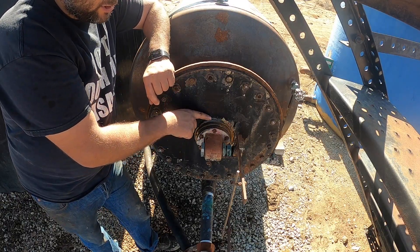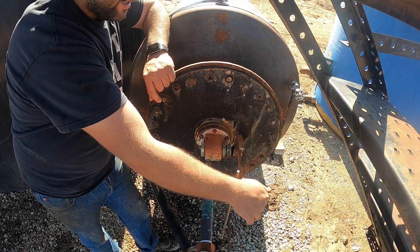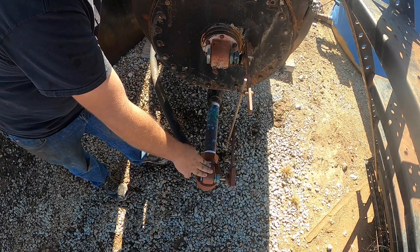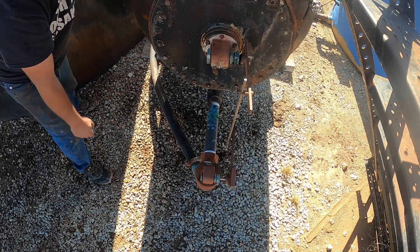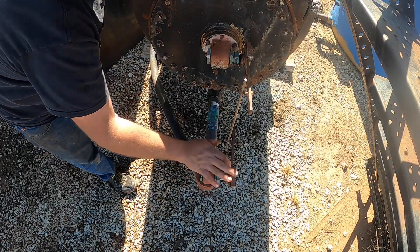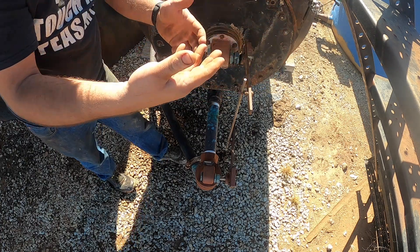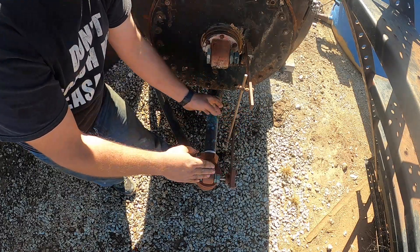The mechanism comes out through a rod here in this packing and ties on to this arm. The float's job is to actuate this dump valve — this is the water output of the separator. This connection goes into the bottom of the separator; the water, already separated, comes into this valve, which is controlled by the float. So if the water level or the contact point goes down in the separator, it pulls this up and shuts this valve, preventing any more water from going out.